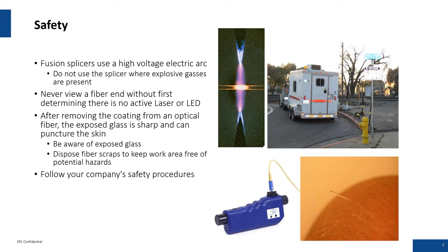The third thing I would like to mention is fiber shards. This is a common problem in the industry when you are working with a splicing van or a workstation. Don't ever take your hand and swipe it over the top of the table. I remember traveling back in the day, getting in splicing vans and helping people work on their systems, and I avoided the cloth chair like the plague. It's just very dangerous, so move away from that type of material. Try to use vinyl if you can and stay away from the cloth seats. Little stuff like this really helps.